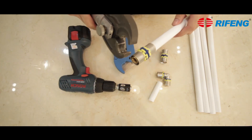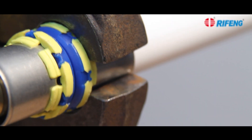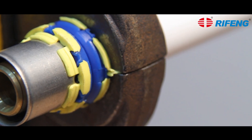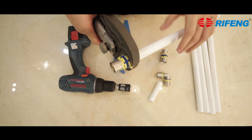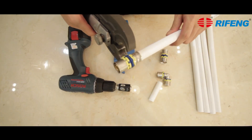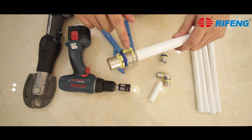Pressing the tail to open the jaw and ensure the plastic block and sleeve are at the right position in the jaw. The margin of the block must be placed in the groove of the pressing section. Operate the tool by holding the trigger until the pressing process is finished. The plastic yellow ring will fall off after the pressing process is complete.